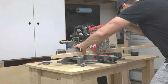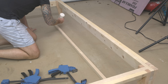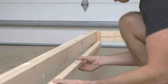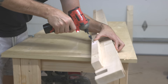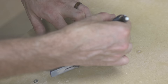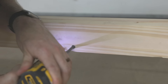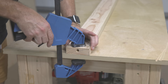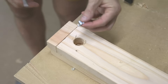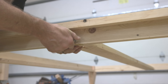I measured and cut the inside ledges that go along the long sides of the bed to support the slats and eventually the mattress. I glued these on and once dry came back with screws to reinforce the ledges. For the center support that runs parallel to the stretchers, I attached each end with a thumb screw — this supports the middle of the mattress and pulls the frame together. I made a drill guide from an off-cut to drill the holes in the center of the end pieces, then used a Forstner bit to make a hole through the stretcher for a T-nut that threads with the thumb screw.